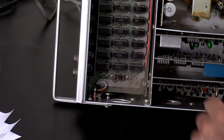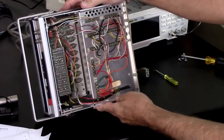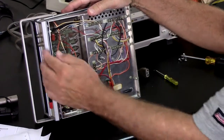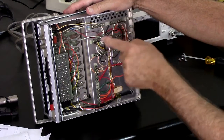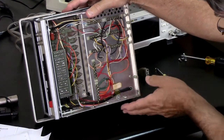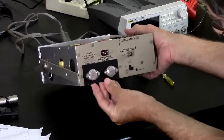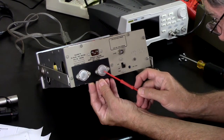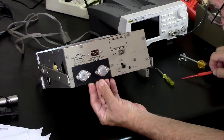There's some foo-foo dust. The boards presumably plug in — here's what it looks like underneath. That board is the switches. The connectors hold the vertical boards in place. Back here are the voltage regulators — that one is seriously dented. There's an LM309K, and I thought it had two 309Ks, but the other one has a different part number on it.